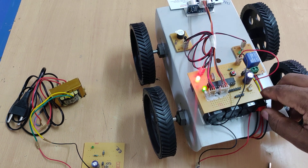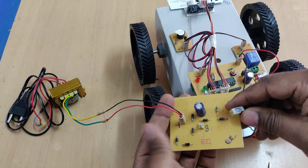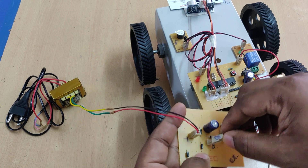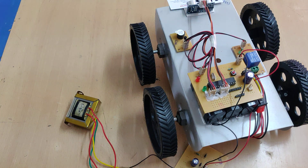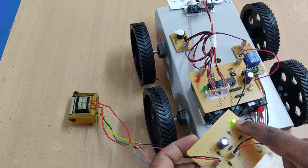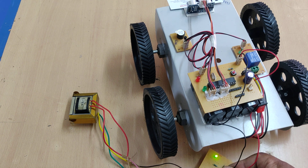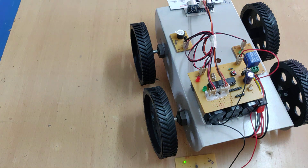This is the main on/off switch. In order to recharge the battery, connect B to B, and transformer to transformer. After the connection is made, switch on the transformer power supply. There will be an indication light on the charging board — a green light showing the battery is charging. We need to charge the battery for at least 8 hours, after which you can disconnect the charging and switch off the charger.